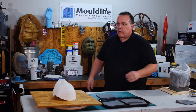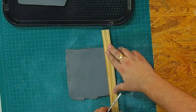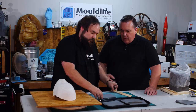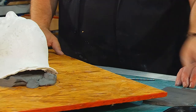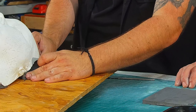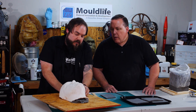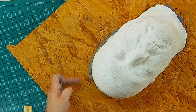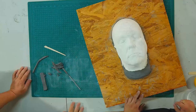This is water-based clay, so it's going to start drying out. Take a paint stick and a simple makeup spatula — it's just a thin piece of metal with no edge on it. I can go in and just add that in, pressing it down onto the wood. When I put another piece on, this is also the same way we'll make keys later. You want to make sure you can get as much of your natural shape as possible. We continued adding strips of clay, filling in the voids between the life cast and the wood until we corrected all the holes, fixed the neckline, and made a full positive shape. When it was done, Brandon sealed everything with a clear coat spray.